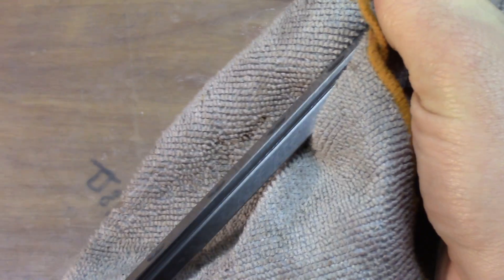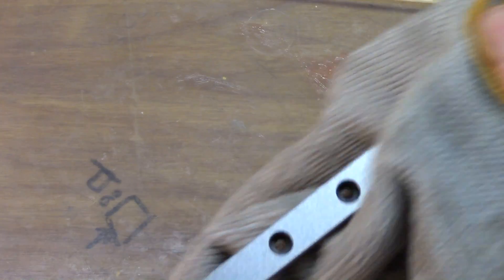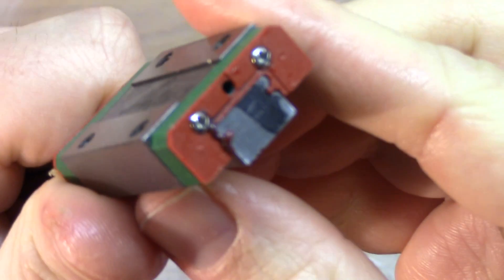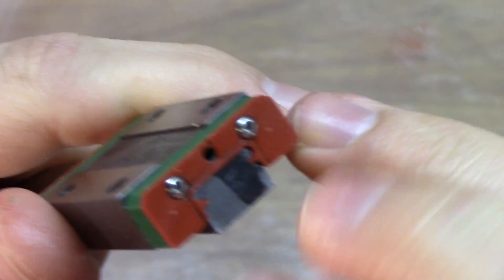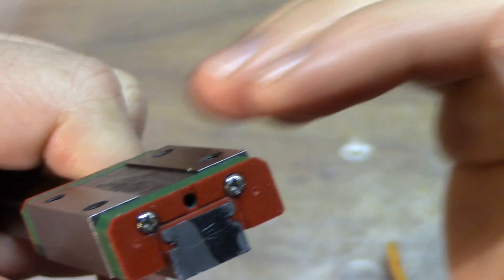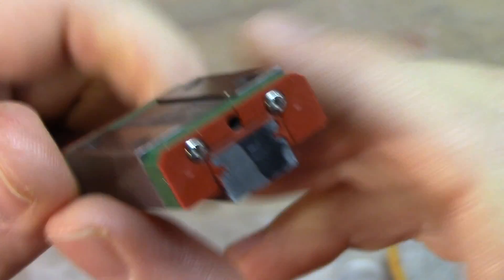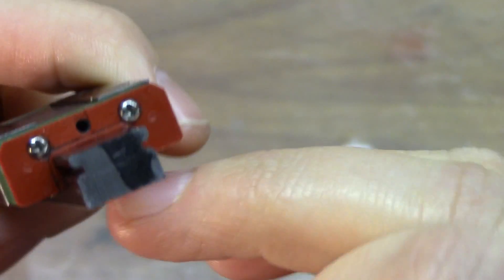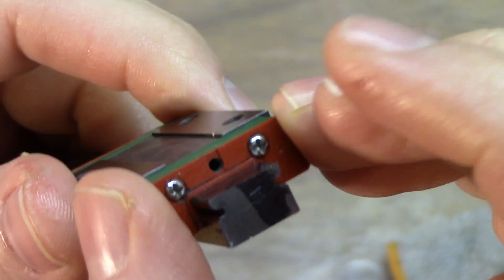You're going to have a lot of extra grease sitting on the rail. One nice thing about these linear rails is that all the lubrication is pretty much self-contained — you get a light film on the inner run but nothing major on the rail itself, so it won't attract as much dirt as an open lubrication system. These also have little fangs that go in the track and clear out debris, and the top wipes the rail as well. If one rail slides smoothly in one direction but is rough going back, loosen the two screws, slide it a few times, then retighten — this reseats the red guard piece to the proper position.